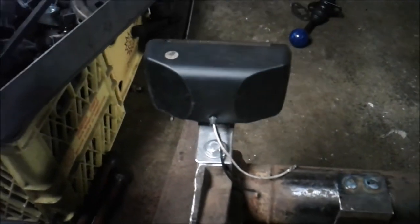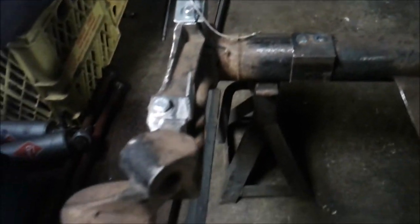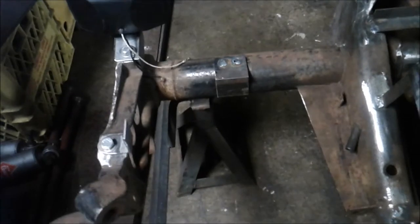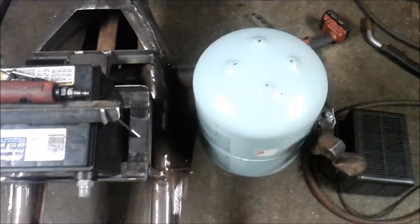I was screwing around the other day. I made a bracket for one of these cheap Chinese headlights I have. It's no high beam, low beam, just on. Literally, it's a fog light. I made extra brackets identical to the others, so when the tank shows up, I should be able to just weld it to this one, weld it to the one that's going to be here. There's going to be a third up front that'll reach the tank. You're going to have three spots, or it'll just rock, tilt, and rip open and start leaking. And it'll be a lot of fun to have gas everywhere.